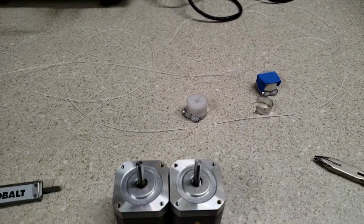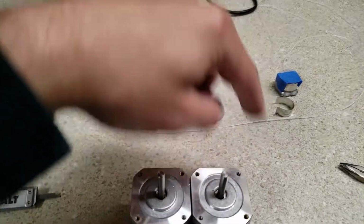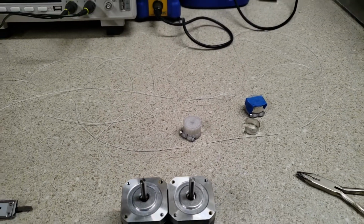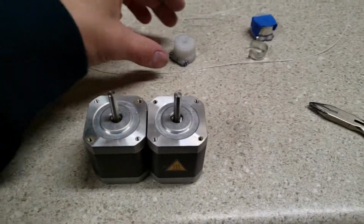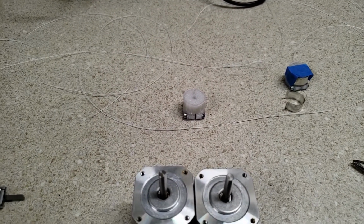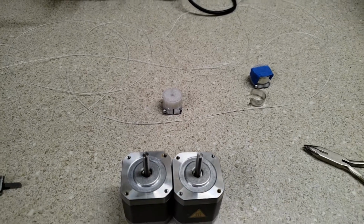So I'm going to be installing these cables with the carriage and the gantry as close to center as possible, so that it's the same run for both sides. And that way I should be cutting off the same amount of cable on both ends. So you don't want to be turning your spools after they're installed and everything. So you want to make sure the cables are all installed with the gantry and the carriage directly in the middle, so that way everything is symmetrical.